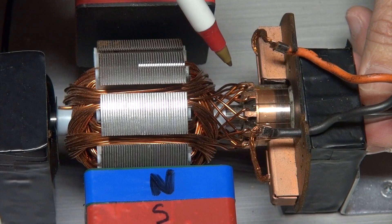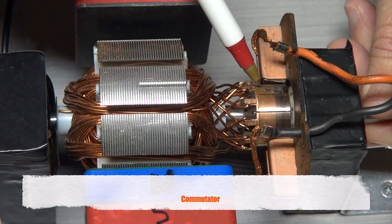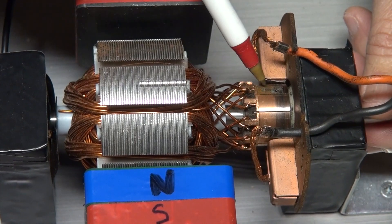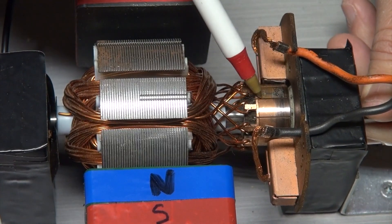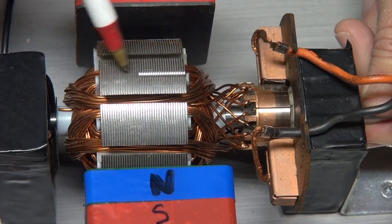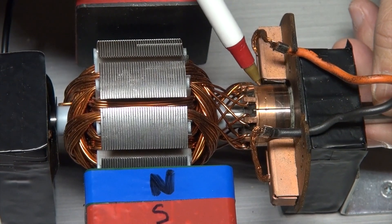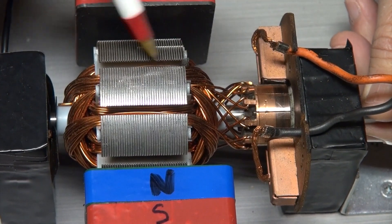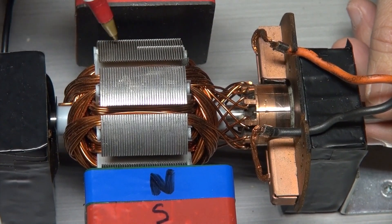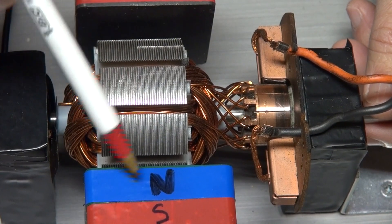The other key component of the electric motor is the commutator. The commutator is made out of multiple copper plates. Each of the plates is isolated — they're not electrically connected. Each plate is specifically tied to the poles. When electricity is sent through the commutator, only the specific pole pair will receive current so that the current can magnetize the rotor's poles to interact with the stator assembly.